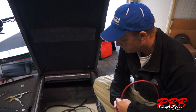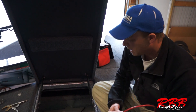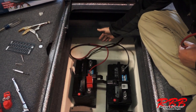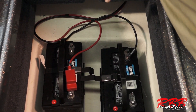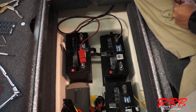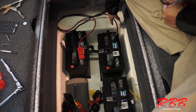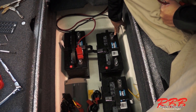What I'm going to show you now is how to hook up a 36-volt system. We're going to run the batteries in series and not in parallel. These leads are coming right from the trolling motor. Since I'm running a 36-volt system I need three batteries, and you need to designate each one: battery number one, two, and three. My positive lead is going to the positive on battery number one, and the negative lead is going to the negative on battery number three.